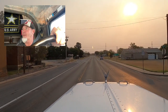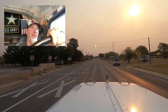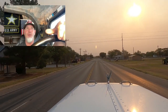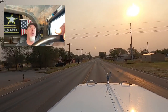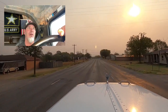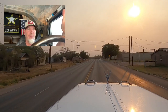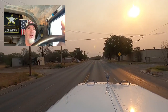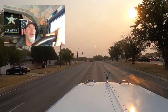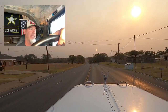These trailers that we're hooked up to, they're 96 wide band trailers that have a false floor in them. And it's got a big hole in the front. You might have noticed it back there in the footage backing up to the trailer. A big hole in the front of it. Well, that hole in the front is where they hook a blower up to. And it blows air up underneath those peanuts to help dry them out before they can get ready to test them and process them.